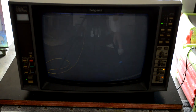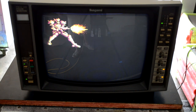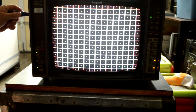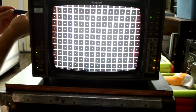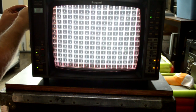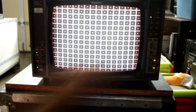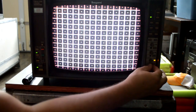The screen looks and works really well. The adjustments are all going to be done by hand through potentiometers on that deflection board — you just use them to get the best looking screen you can. We're going to concentrate mostly on the vertical adjustment, more than the others, because the other adjustments all seem pretty good and have held well for 30 years. Just a couple of turns on those potentiometers and you're good to go.